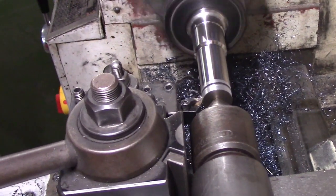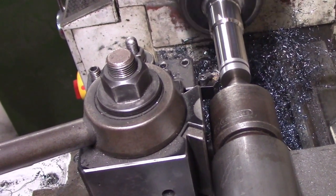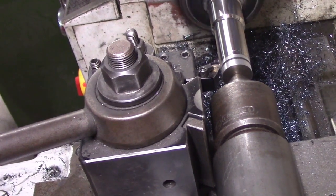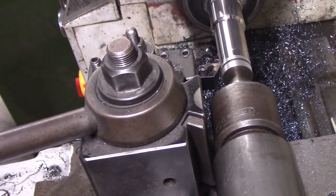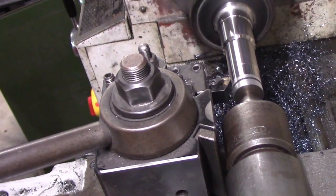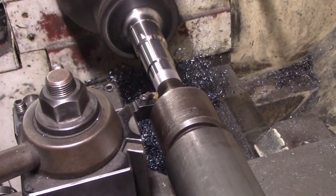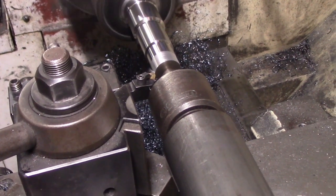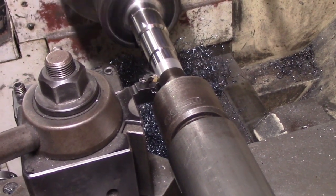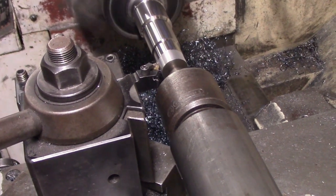What's interesting here is you can quite clearly see how the end of the existing Jeep CV joint is not heat treated. Obviously the splines that have now been machined away were induction hardened, and the end was not. And so the hardened section actually machines much easier, as I've already said, it leaves a nice surface finish, whereas the soft end, which is kind of gummy, was leaving a very rough surface finish. Luckily, in the final product, after I cut it to length, that unheat treated section gets cut off, so it's really not that important. It's more of a curiosity.